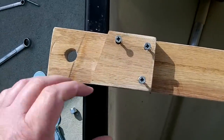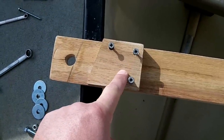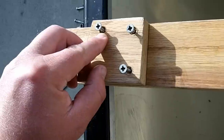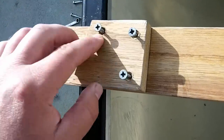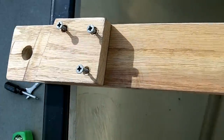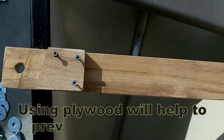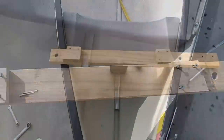Now you just take your wood screws. I like to drill pilot holes first — that way it won't split the wood out. The pilot hole is just big enough for the shaft of the screw and leaves the thread so that it can go through the wood. I've also countersunk these so that these screws don't split the wood. Go ahead and screw those down — I'm going to do that right now.